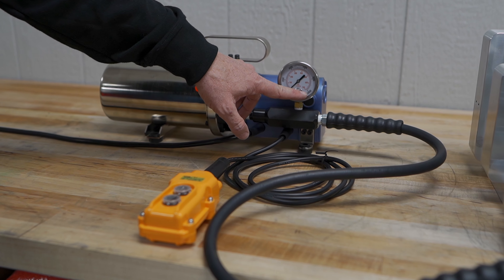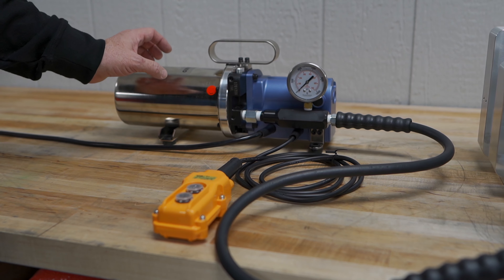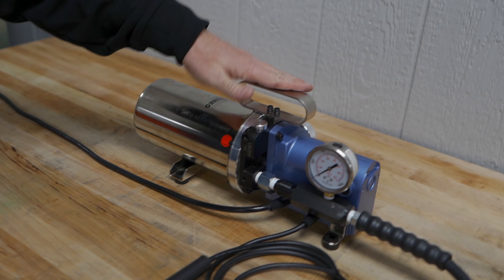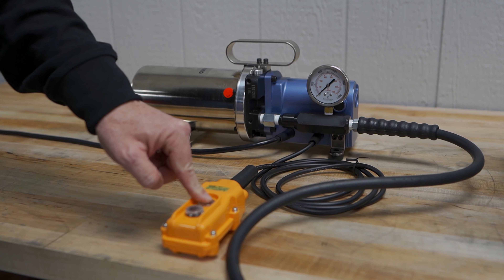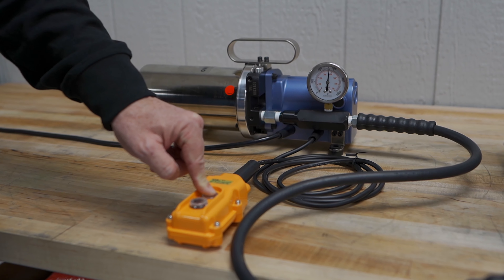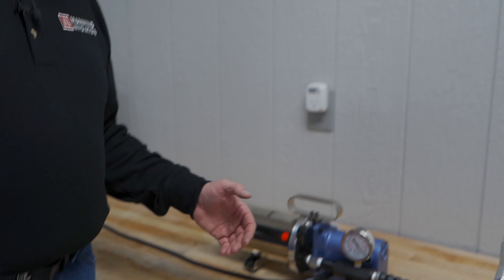Today I want to show you operation. Operation is very straightforward. To begin with, you will close the knurled knob on the back, which is the clamping valve. You'll close that clockwise when viewed from the knob side. Then you will push this to operate the pump. As you operate this, the pressure will rise. You'll wait for it to get up to the 10,000 psi mark, which is the full rated pressure for any clamp — in this case the 25 ton clamp.